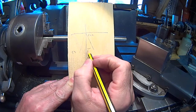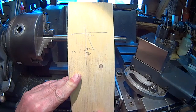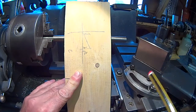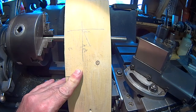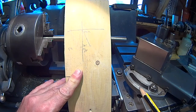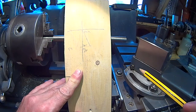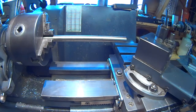If we then draw a right angle, we know that's 90 degrees. We need to calculate the actual angle to set on the top slide: 90 plus 27.5 is 117.5 degrees, and you minus that from 180 — because that's the three sides of your triangle — which gives you an angle of 62.5 degrees. So that's the maths.